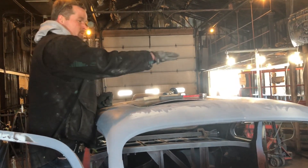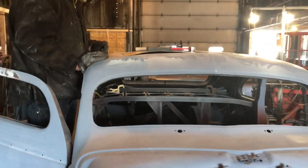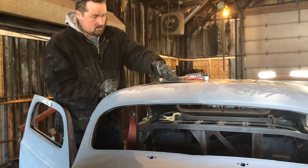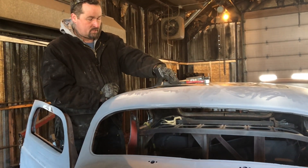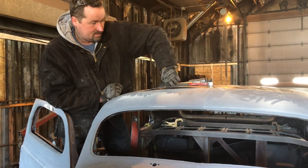I made this piece with the English wheel. I had to crown it this way and had to crown it that way. You can see this side is perfect now. What happens is when you're welding stuff like this and you get it spot welded, you start getting these oil canning high spots like this.